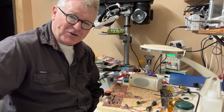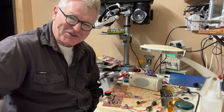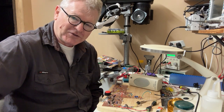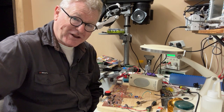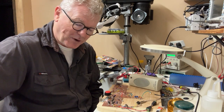My permeability tuned oscillator was very unstable. I had just used ceramic capacitors — bad move. You do need to use temperature-compensated NP0 capacitors. I got some from my friend VK3ZZC, who gave me a little bag of them some years ago. I dug it out and that fixed the problem.